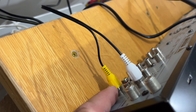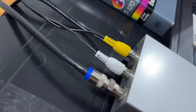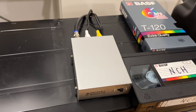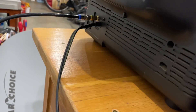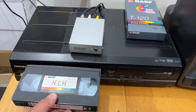What I did is connect the RCA outputs here — yellow for video and white for audio. The red is not used because this is a mono modulator. Then the coax cable outputs to the back of the TV.